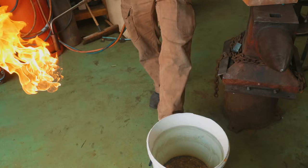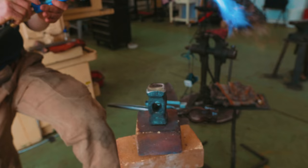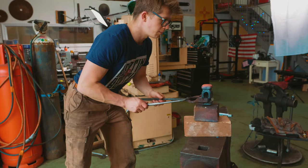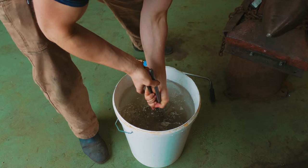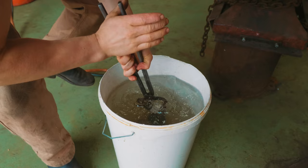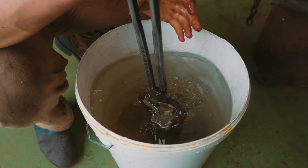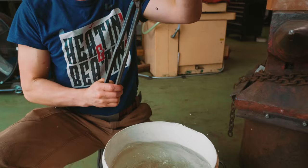It also means that instead of hardening in oil we need to cool it down as fast as possible, so we're cooling it in cold water. I like to start on the round face when I'm heating it with the torch because what it does is it jets down the flame and it will heat up the other side too much otherwise. Then into the water we go and I'm shaking it very vigorously. There is something that happens called the Leidenfrost effect — the hot object in the water is creating a steam jacket. That steam jacket is not conducting the heat out of the workpiece as fast as the cold water itself, so I'm shaking it around to make sure that we're putting fresh cool water on the hot steel to get it cooling fast.